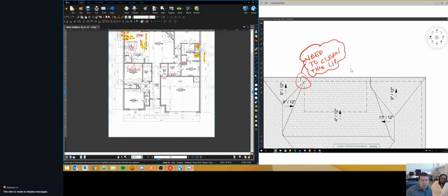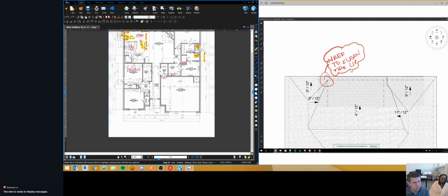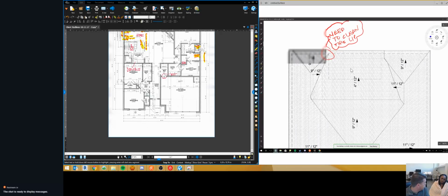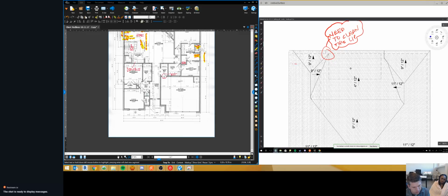But a couple of things real quick. I noticed on the garage left version, and you'll see it, I'll send you some red lines. You changed the roof, but on the roof plan the line is still down here, so we want to be sure that gets moved up to within a foot. You don't have to dimension it, but it should look the same. That line should just be straight across, right across there.